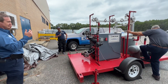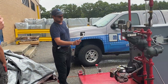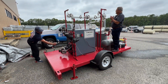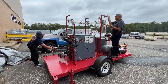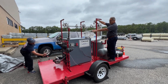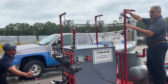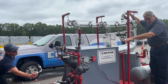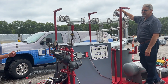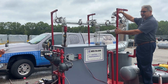On a commercial building, you might have zone valves that open and close. You want slow opening zone valves typically, not fast opening zone valves. I'm going to do it a little slow and then fast, and we'll see what happens. I'm not boiling right now, but I'm at steam. As soon as I open this and the pressure drops, the burner is off — I'm not putting any more BTUs in there right now. I'm still absorbing some through the cast iron, but you're going to see that water start boiling immediately when I take the pressure off.